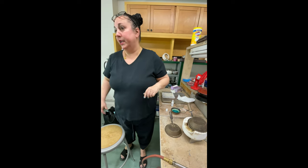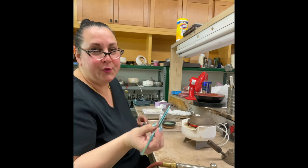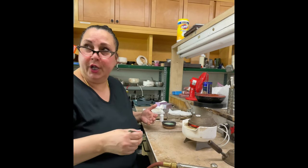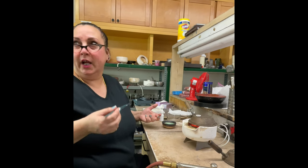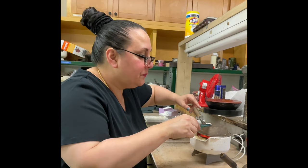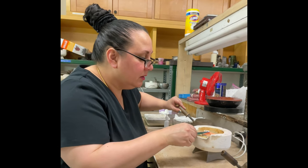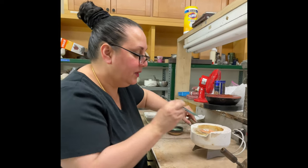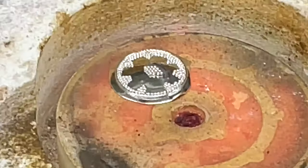This is the spot where we added the granule. I'm going to stick it in and fuse. Even though we're only doing one granule, the procedure is still the same — get the whole thing good and hot and push the heat underneath that granule. I don't need to flow it all over the whole thing; I just need to see it flow under the section where we added the granule.